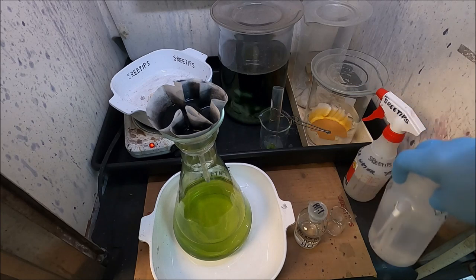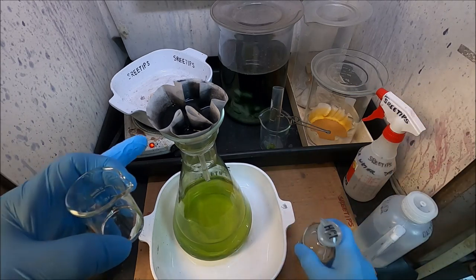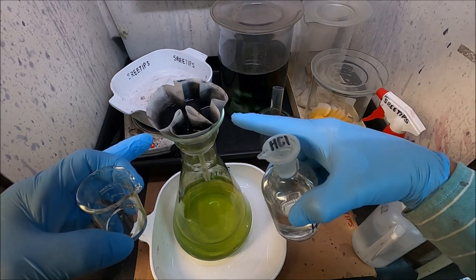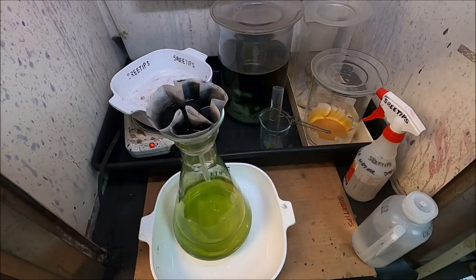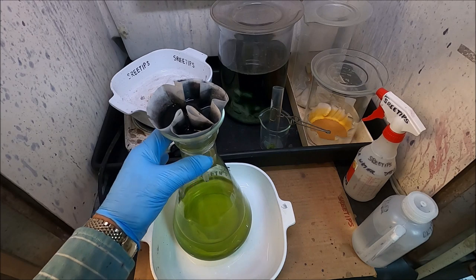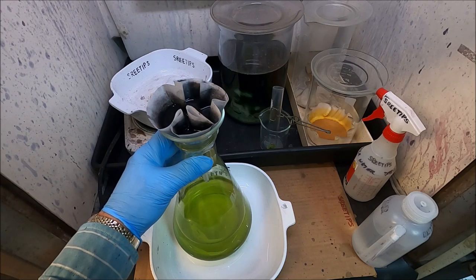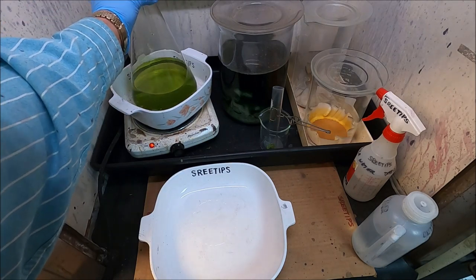We've got all our values concentrated here, and I've got all the black PGMs and other insoluble material gathered into this filter. Got all the silver rinsed out. What we'll do now is, once this last rinse drains out of here, I'll roast this and burn off anything that's combustible, and then we'll dissolve it in aqua regia. But for now, I'm going to set it back up here out of the way.